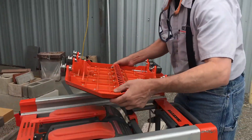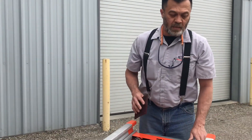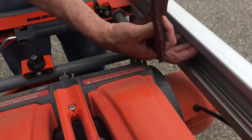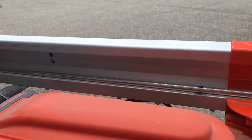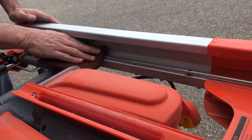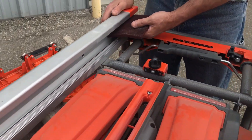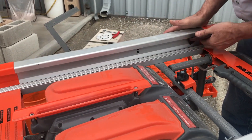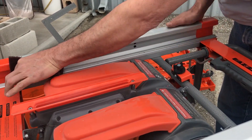Routinely, what you should be doing is cleaning. You've got to keep in mind you have upper and lower rollers on the table. The upper rollers ride on the upper side of the table up here, so any irregularities on this surface will also cause a bump. Take Scotch-Brite and just run it across nice and even, and then also on the rail itself, take the Scotch-Brite and run it across. You're in a construction environment, so you're still collecting dirt and whatnot as you do your work. So on occasion, every now and again, run Scotch-Brite across the top and leading edges of the rails.